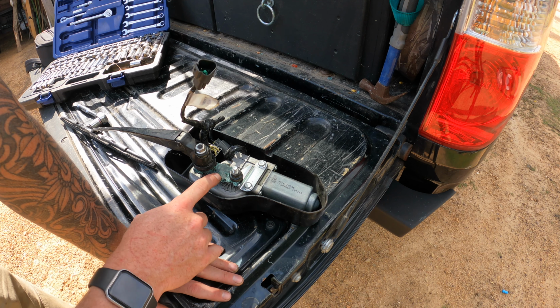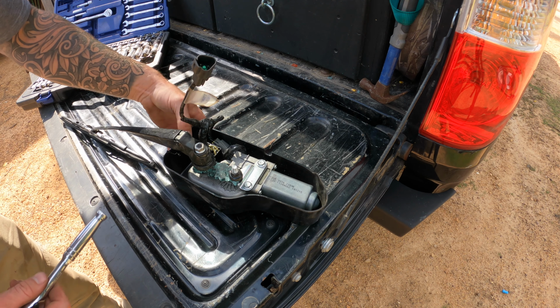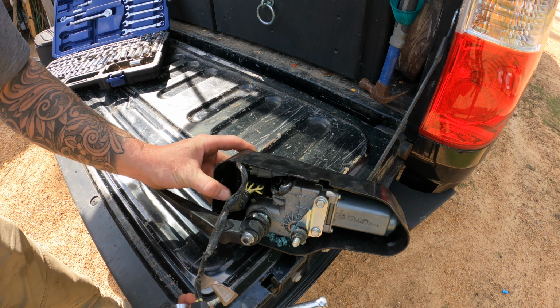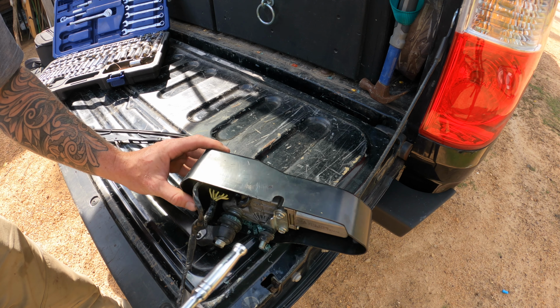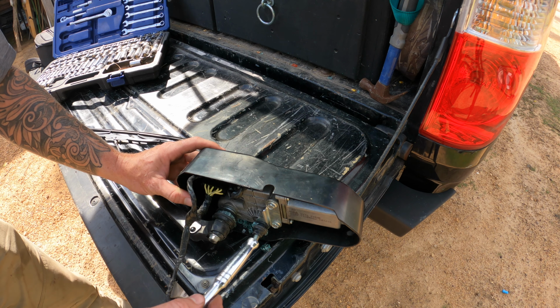tempered glass just breaks into 100 pieces. So I'm gonna get my finger out of there before I really cut myself. We're gonna get this glass out. It's just a matter of unscrewing this, and pulling them off, sliding this piece of equipment on, and sliding these back on without breaking the glass again. We want it snug, but not snug enough that it's gonna crack the glass.